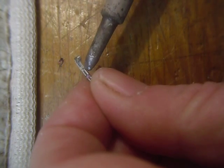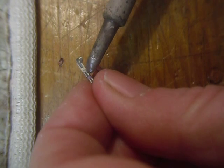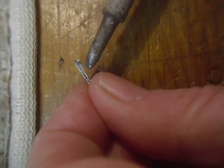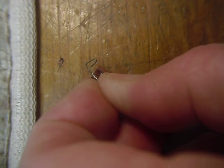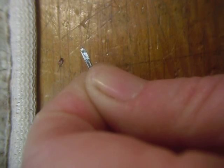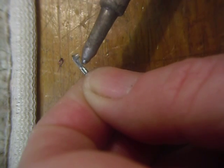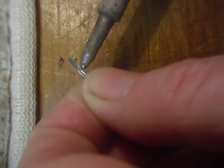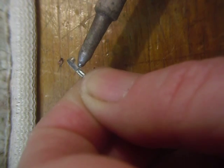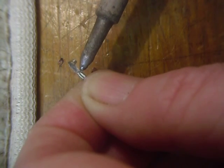Like I say, these things look like they're crimped absolutely perfect, but there is a little bit of tarnish that has developed between the wires and the connector pin itself right here, and it's a bad connection. This is what I ran into with the IC-211 connectors — I thought it was such an unusual, funny, weird little problem that I should present it and show how I fixed it. I soldered each one of those on connector J2. There are a lot of other connectors on there; I didn't do all of them because I was afraid I might mess something up and cause myself more trouble.